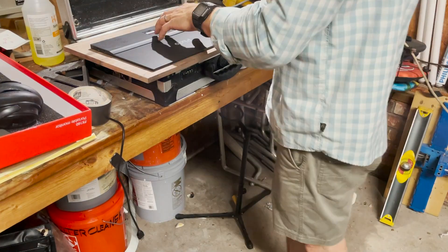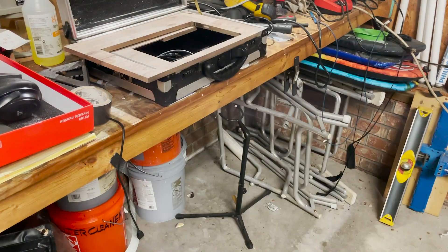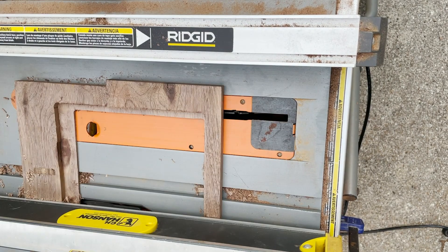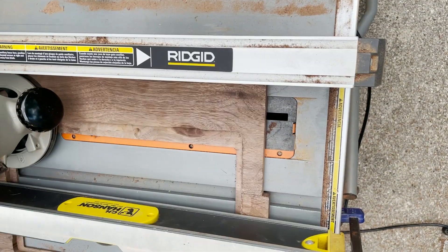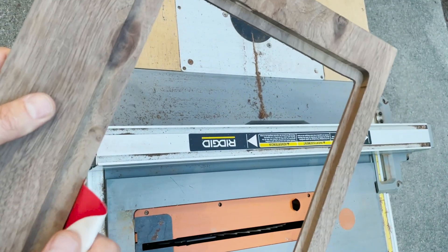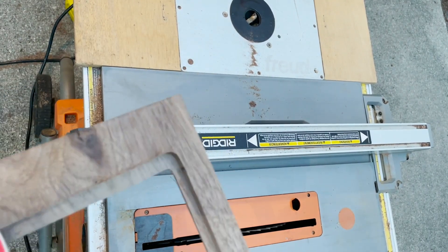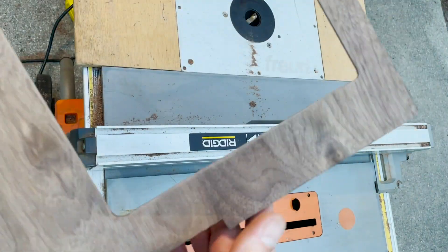One tip is to get your jigsaw line as close to your final line as possible — it's just easier on your router bit. The large through-cut I just made was just big enough for the visible part of the screen I want to see. About three sides of the monitor have about a three-quarter inch bezel, and the bottom of the screen has about a three-inch bezel. I don't want any of that bezel to be seen, so I'm going to recess the screen into the lid. This is a really long process — in woodworking you can always take more wood off, but you can't add it, so I just go slow and take material off at like a 64th or 32nd at a time when dealing with really precise electronic work like this.